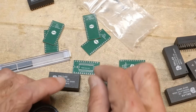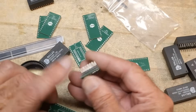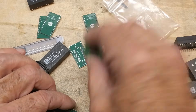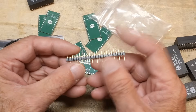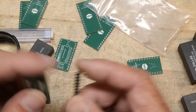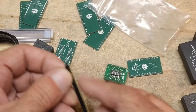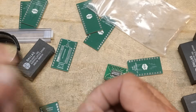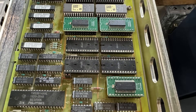I loaded these up. When you put pin headers on the boards, do not use the standard headers that everybody's used to, because they won't fit in your socket — especially if you have a pin socket. You need to get yourself some nice round pin socket long pins. The ones I have here are fat on one end and skinny on the other. Make sure the skinny end is down, because it's the skinny end that goes into your socket. The fat end won't fit. So skinny end to the outside, fat end to the PC board holes.